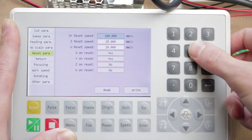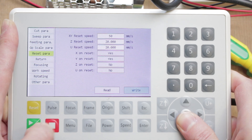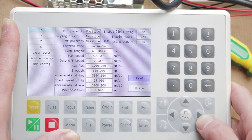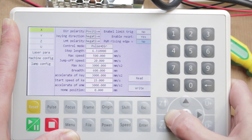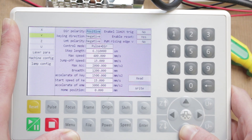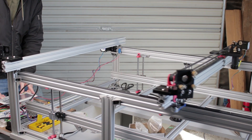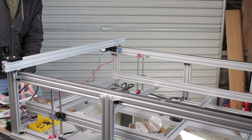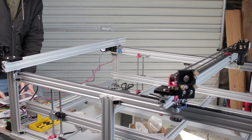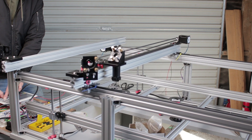I've spent some time mucking around with the settings and it doesn't seem possible to turn these beeps off — if someone does know, please leave me a comment. What I've actually been doing is going through and turning some of the speeds and accelerations down so I've got a safety margin while I try things out. I also told it how big the bed was and where my homing location is, and now everything's moving around quite nicely. As a side note, the linear rail on the X-axis that I said was feeling a bit slow back in episode 2 — now with the grease properly worked in with a bit of movement, it's feeling a lot better.